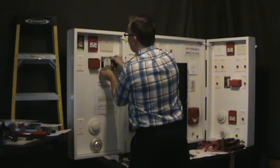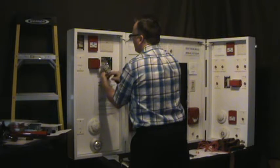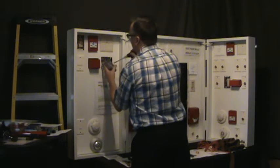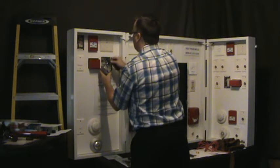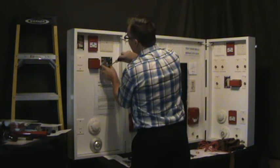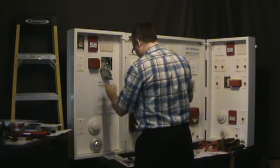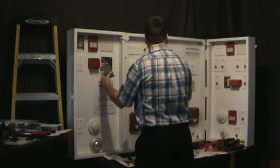This is a slightly different version, or model. Again, we still have 1, 2, 3, and 4, so we're going to take one off. Should give us our open. Addressable loop open, we got it. Put that back together. Now again, make sure these screws are tight. Don't over tighten, you don't want to break the screw. Now we've got to do our short. Do our reset on this.